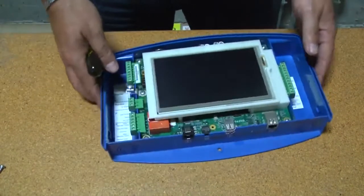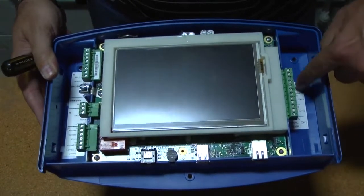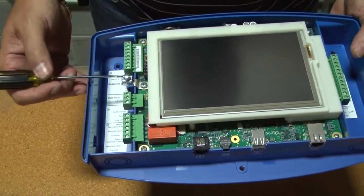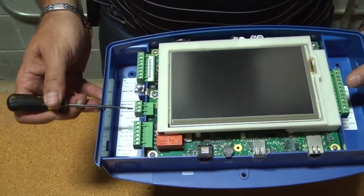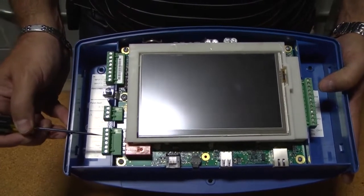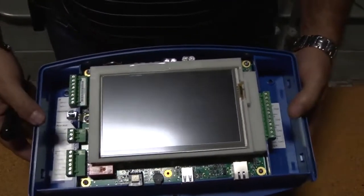You can see the inside of the box. This is your probe side. Starting from the bottom: channel 1, 2, 3, and 4. Your external inputs, RS-422 and 485, your IS ground. Then you have your earth ground, your neutral, and either single phase 120 or 220. Looking at the connector from top to bottom: normally closed relay, normally open relay, and then the common — and then your second relay: normally closed, normally open, and then your common.